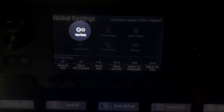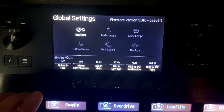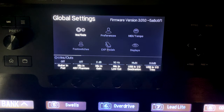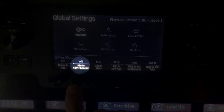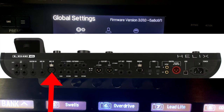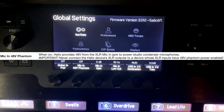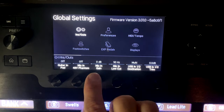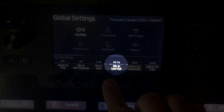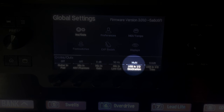Now ins and outs - complicated but worth knowing. Guitar In Pad: off or on. If you have a super hot guitar with active pickups or just too much signal, turn the pad on to reduce the input level - trust your ear. Mic In Phantom Power: if you're using the mic input with a condenser mic, turn phantom power on here - there's a warning in the manual about this. You can also adjust mic gain from 0 to 60 dB, and there's a mic in low cut filter.